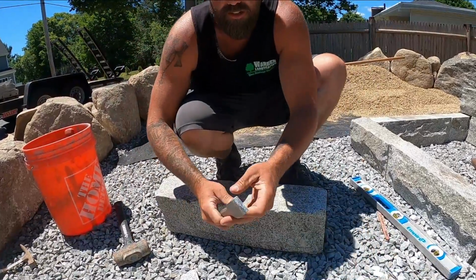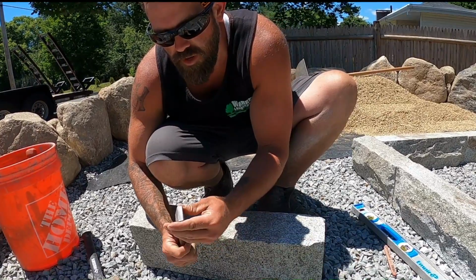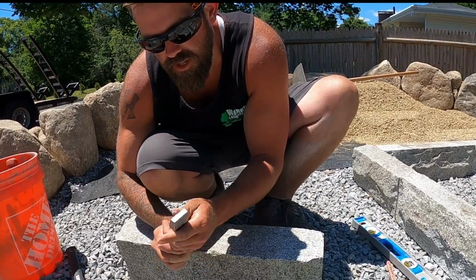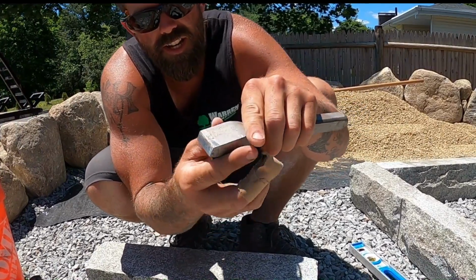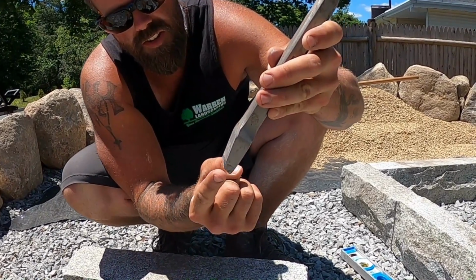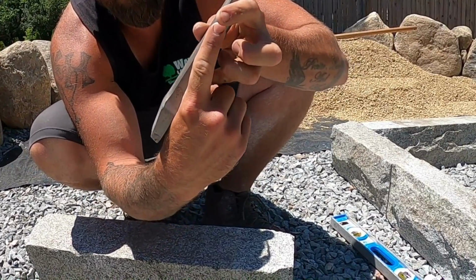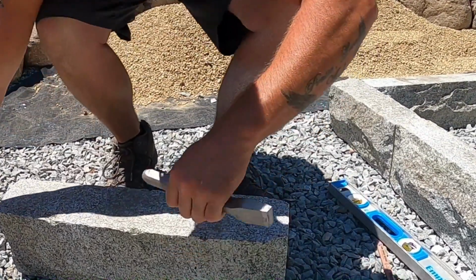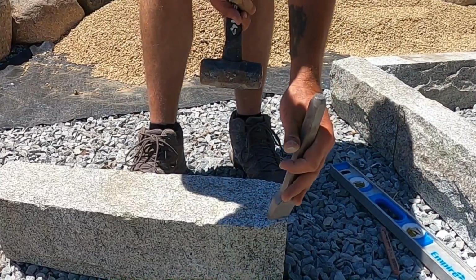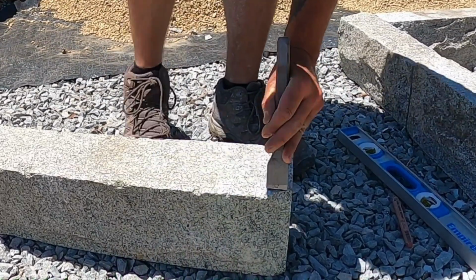So what I'm using, guys, is a carbide tip, about 1 1/8 inch carbide slanted tip, slanted forward, and that's the way I'm hitting it, with the slant going forward and the chisel at a good angle, a good degree backwards. This wouldn't work so well with just a regular steel tipped blade, or chisel, I mean.